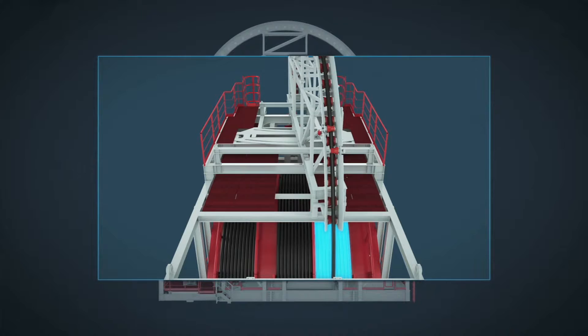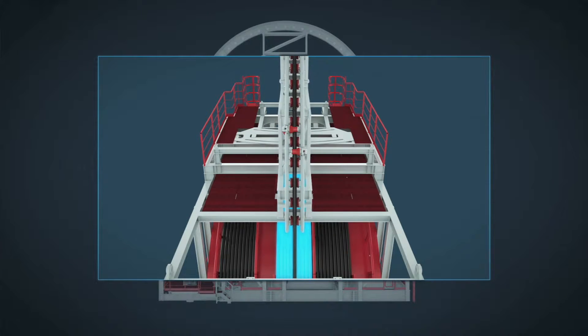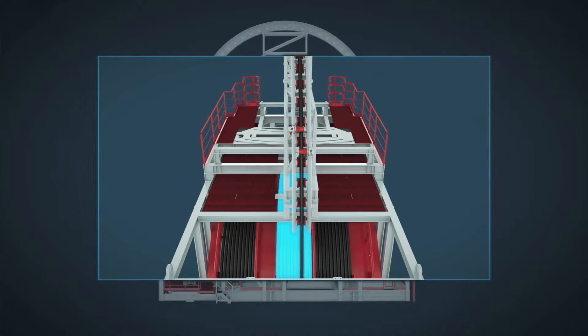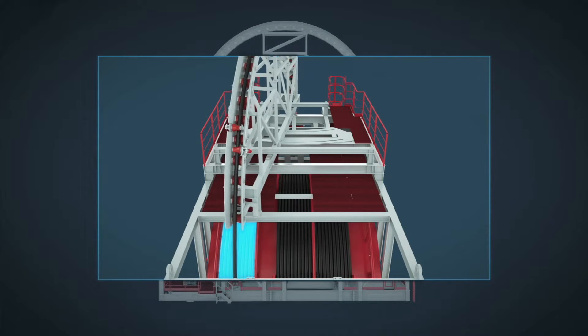The chute on the IDP is quite unique to this system. It takes the pipe from the back of the reel over the top of the machine and down into the tensioner. In doing that, it fleets each of the partition sections to the centre of the tensioner by pivoting across the top of the machine.